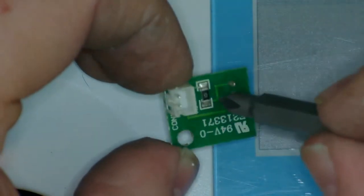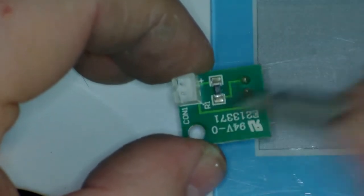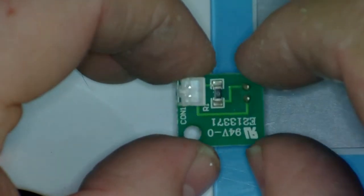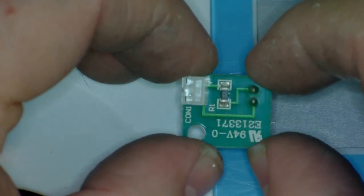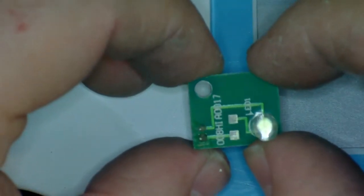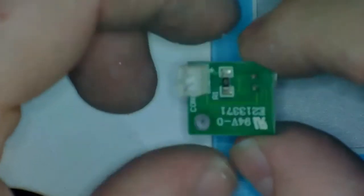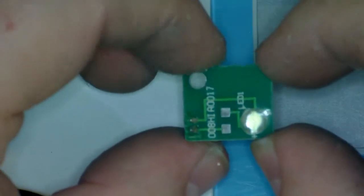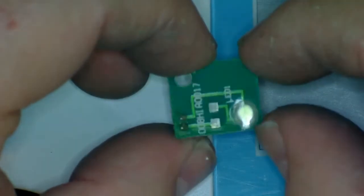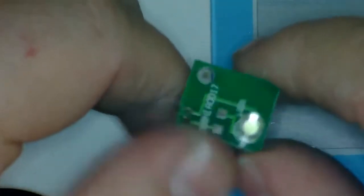Also, I don't know what's going on with this 90-degree trace. That's just ridiculous. Just, you know, run a trace. I don't know. It just smacks of, let's just call it cheap, or it's either cheap software or an inexperienced engineer. There's really no reason to do all this 90-degree trace stuff. I mean, I don't know. Oh well. What are you gonna do?